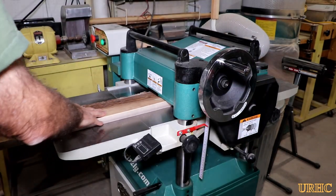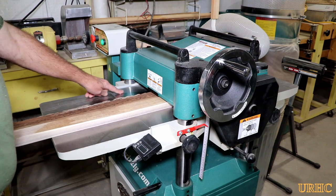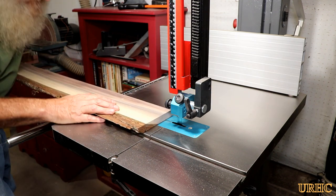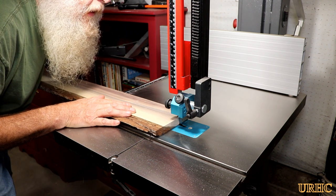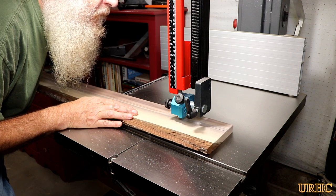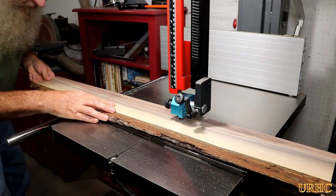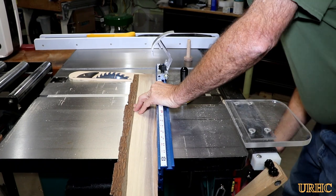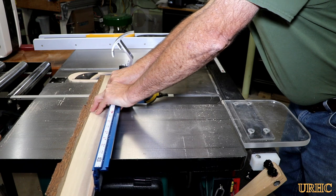You have to go carefully but the bark actually does stay on well. Then I figured out the exact piece I wanted to use and went back to the bandsaw — there's no real straight edge yet to go by, so I just marked it off and carefully cut as straight a line as I could to clean it up. Sometimes you have to fiddle around when you're playing with natural edge stuff, then it's time to cut it to length.